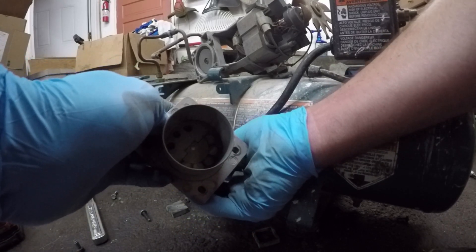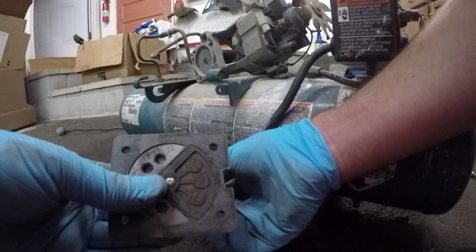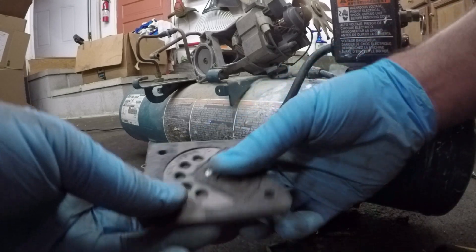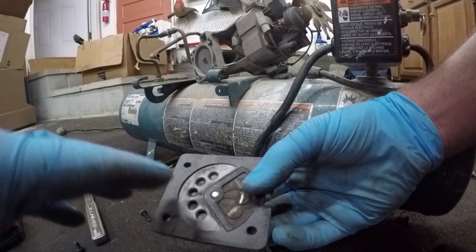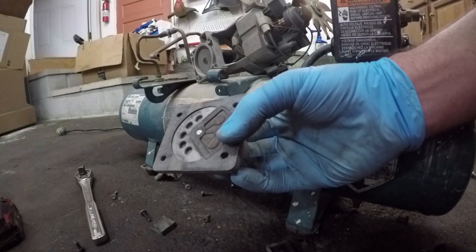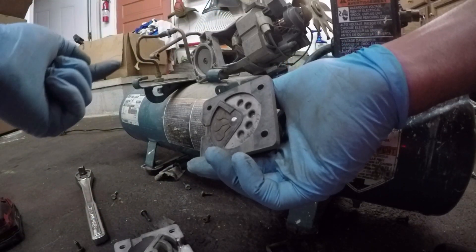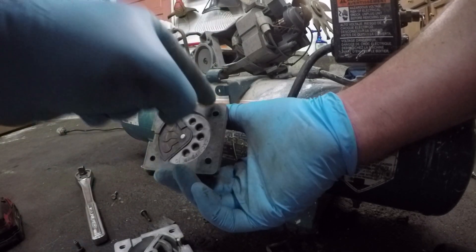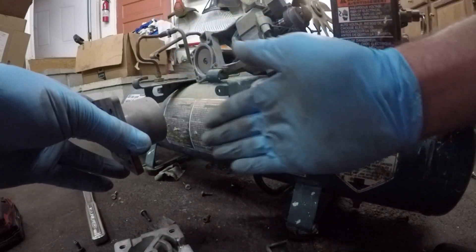All of these are really just a simple directional valve — it allows air to come in from one side and not go back the other way. By lightly pressing the backside of these with a screwdriver, you can see these functioning and how they fold up and out of the way. Anytime air gets sucked in or pushed out of this piston, it creates a pressure difference between the two sides. That air forces those valves open so it can go through. Then as the piston rebuilds pressure, it reseats those valves so air cannot go out the way it came in, and has to go out the other side, pushing those valves out and then down into the pressure tank. The exhaust side also has these same valves — otherwise that compressed air would push back into the piston and potentially leak out, which would defeat the entire purpose of having this tool.